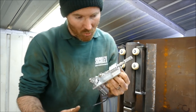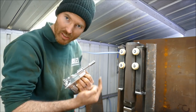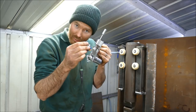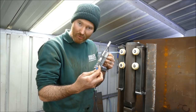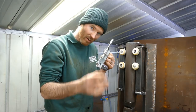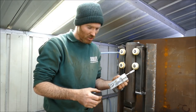That was really cheap, and this is something that I can just stick onto the power hammer. What I would do is connect this linkage here to the valve, and then that would control a reciprocating motion of the valve. And I'd link the potentiometer to a foot pedal. So as I take my foot off the pedal, it comes down, press it slightly, I can get that very slow movement, that very slow control, as you saw me do with the power hammer, just using my foot.